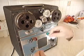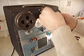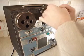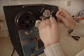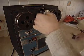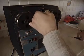Editing with a wire recorder is very crude. You get hold of your two bits of ended wire and you make a loop. You tie them literally together, which is not very easy, like so. Then once you've created your loop, you cut off your excess, like so.